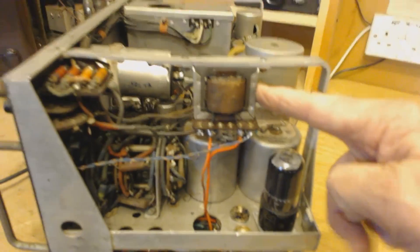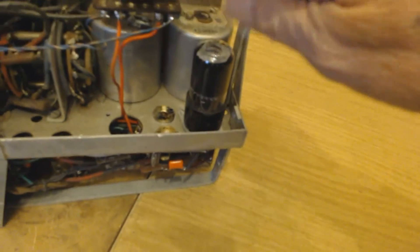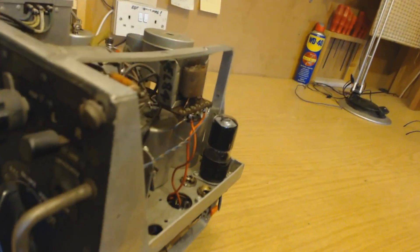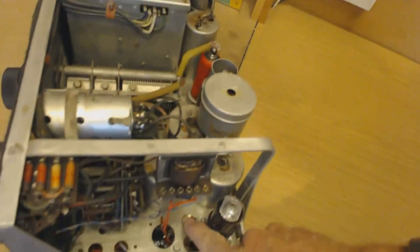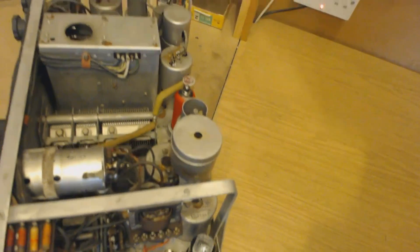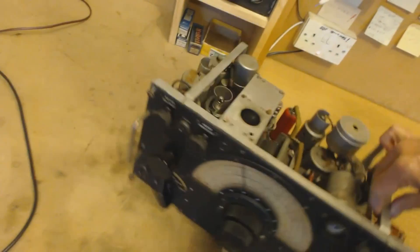That's an output transformer I've put in. I did drill two holes in there - sacrilege, totally ruined the thing! No - I've put a 6V6 there, there's the output transformer, and the audio for the speaker jack socket there. That's all I've done. I haven't touched the rest of it. You can see these are decoupling capacitors - funny things - and there were two here, huge great things. Looks like someone's replaced those two, though it wasn't me. Basically I've not done anything else to this; it's just as I got it, apart from the audio amplifier.